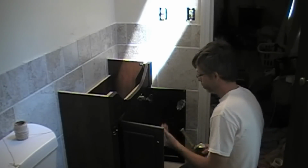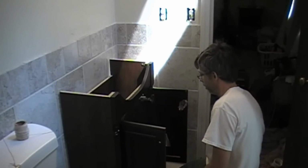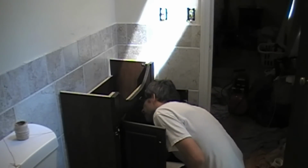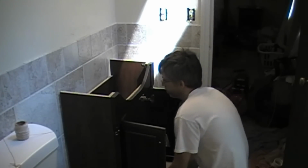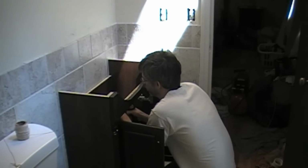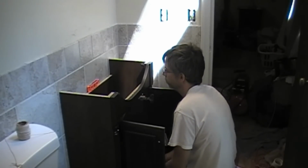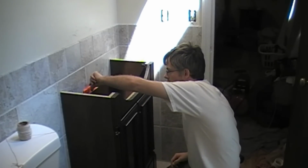The way to do that is I'm going to pull my vanity out just a little bit. Okay? I'm going to take my tape measure and let it grab the grout line. I can hear the difference. Now I know it's in the grout line. It is approximately a 1/2 inch up from the bottom of my plate. Front to back, we're level. Side to side, we're level.